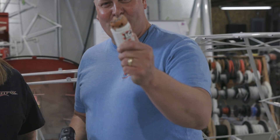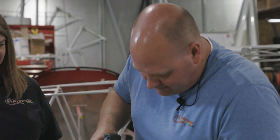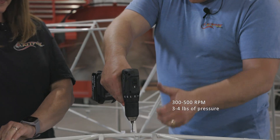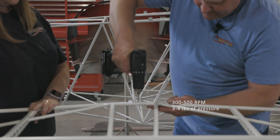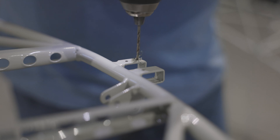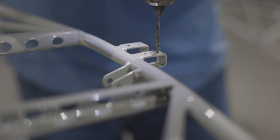We've got a little lube on our number 40 drill bit. Even though the manual says 34, we're going 40 first. We're drilling steel, so we're going to go just a little bit slower RPM and a little bit of pressure. You can see the ribbons coming off — that's a perfect drill. It means we've got a sharp drill bit and we have the right feed and speed rate.